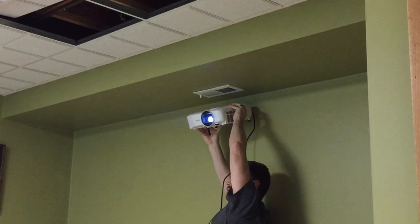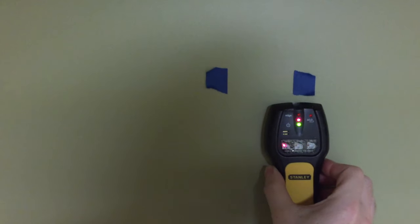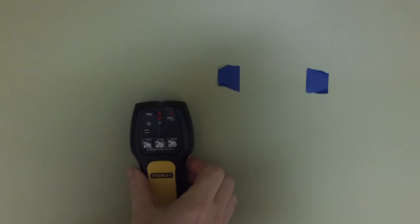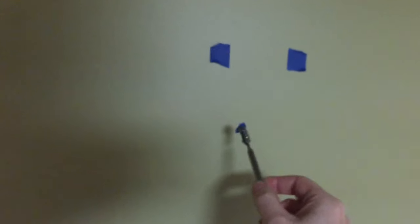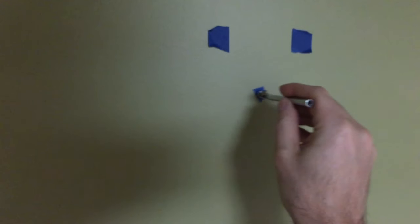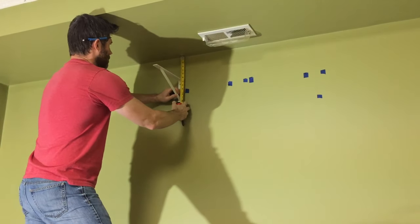Next up is to hang the projector. Being under the vent, I decided to install a shelf below the vent. This provides a surface to hang the projector from and also acts as a thermal barrier between the vent and the projector, so the vent is not blowing directly on the projector. First, I located the studs. I marked them with painter's tape so I don't have pencil marks all over the wall. All of my stud finders are a little off — I know my studs are an inch and a half wide, not two or three inches as the stud finder suggests. I like to use a magnet to find the drywall screw to confirm the center of the stud. The studs are marked out.